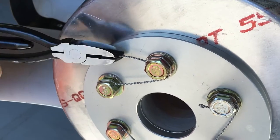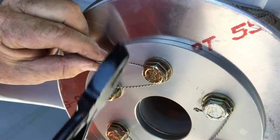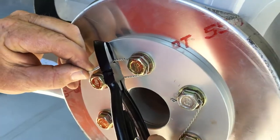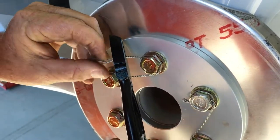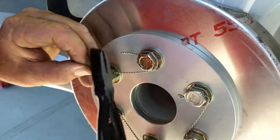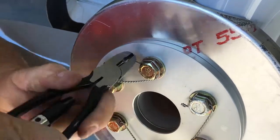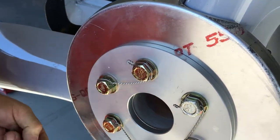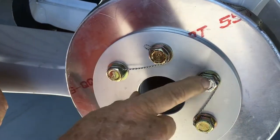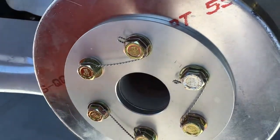I used more than seven turns on this. There you are — it's all set to go. All we have to do is cut it right here, then take your pigtail and turn it back around. You do that so that you don't snag your fingers on the pigtail. You're all done.